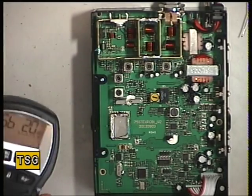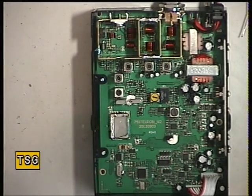The first thing we're going to do is we're on channel 20, we're on the UK band, and we'll just see if it's on frequency. And if it isn't there's nothing I can do about it — and it's on 27.79126, which is absolutely spot on.